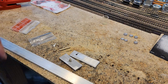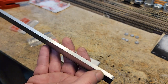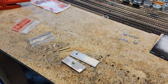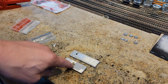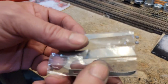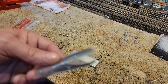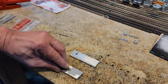So I built a tool. To build this tool I used a piece of aluminum bar stock from the hardware store — it's quarter inch thick. I took my hacksaw and cut off two pieces: one piece slightly longer and one shorter. Then I drilled a hole for a 3/16th brass rod, put a piece down in there, and cut it off. Then I took one of these precision saws and put just a tiny cut in the top of it. Put them in an exacto handle and you can make that little cut there in brass. Very easy.